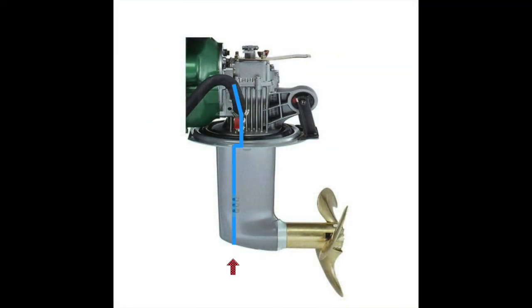That's the pump all done. I just wanted to go through the water path through the engine — how it goes up through the drive leg. There are three holes on the sides of the drive leg but the water path is actually vertical and there's a clearance hole in the very bottom of the drive leg for rodding out anything in there. Unfortunately these drive legs have an Achilles heel: right at the top of the drive leg just before the seacock there's a corner that allows stuff like weed to get caught. Here's a top tip — you can simply connect your dinghy inflation hose from the pump straight to this line and literally blow it out.